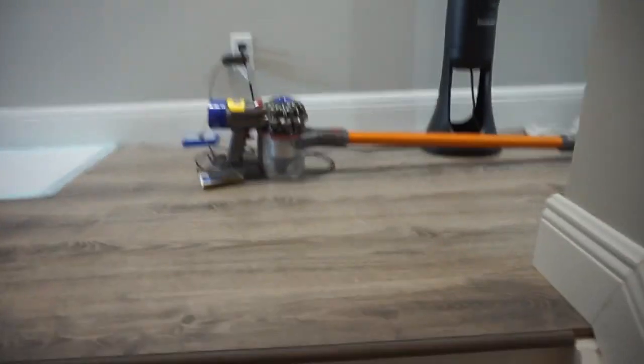That brings us to the second level where the staircase continues. We go to 36-inch height on the handrails on the staircase. I made a custom stair nose at the top of the staircase — it's actually a piece of tread nose. This is a two-piece nose that I put together so it's L-shaped: it covers the front of the laminate and then goes and covers the bottom. It is not glued or attached to the structure so the laminate can expand freely. It's glued and screwed to the laminate itself, but the laminate is not pinned down in any way, so it can still expand freely without any problems.